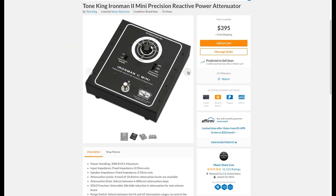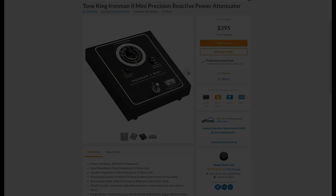Other reactive load attenuators on Reverb include the Rivera Rock Crusher and Tone King Iron Man 2. One thing to remember is that when you have the attenuator backed off quite a bit, you're going to hear different frequencies. This is well documented in the equal loudness, or Fletcher-Munson, curve — basically we hear more mid-range and less bass and treble at lower volumes. As you turn things up it tends to even out. This is why we see treble compensation on the Weber: when you back it off, you actually get that clarity back.